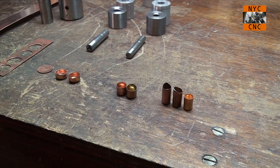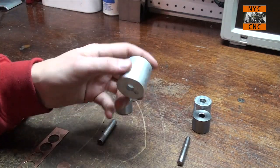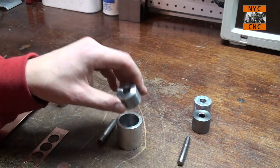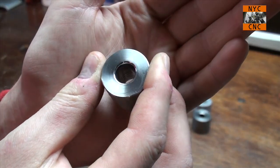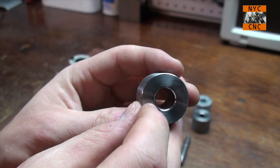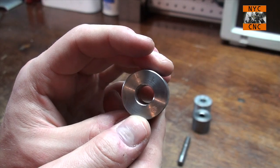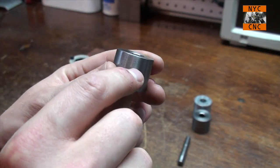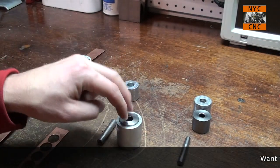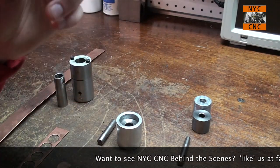So let me show you my system here — it's pretty straightforward. I've got this universal holder, and all you do is stick your die in this holder. I spent a lot of time trying to polish the inside of that die and get it nice and shiny and smooth, including this radius lip right here — that's where all the mojo is. I also machined out a stepped diameter on the bottom half so that once you push the jacket about halfway through, it'll just fall through; the drawing's done by that point. You set it in here like so, and then this just serves as a bushing — and this is probably a weak point, it's still aluminum.